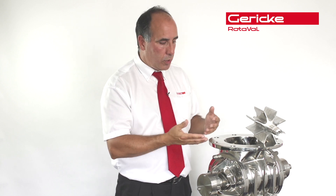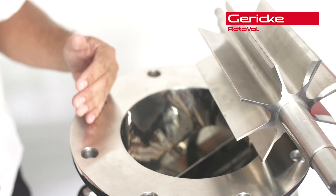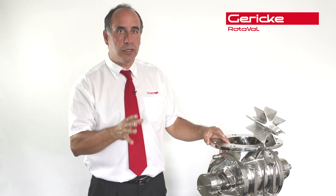The basis of any product that has a tendency to smear is to make sure you have the design of your equipment suitable for what you're actually handling. The main criteria are polished surfaces, chamfered edges, serrated vanes to stop product build-up, and the ability to pull the valve apart. Once you've got all those combined, a valve will last for a very long time and you will not have any operational issues. I hope I've explained the difference between the squealing side — metal to metal and product related. Please do not hesitate to contact us if you have any further issues. Thank you.